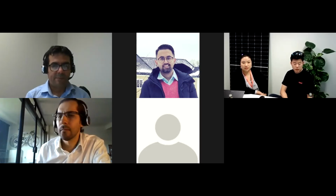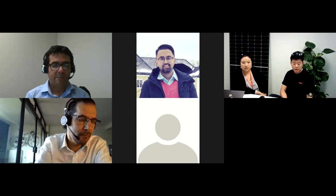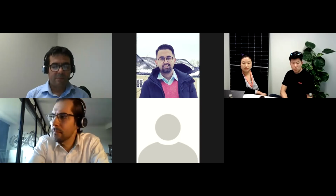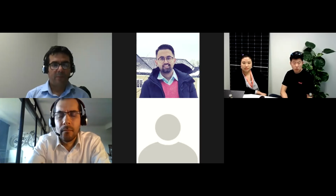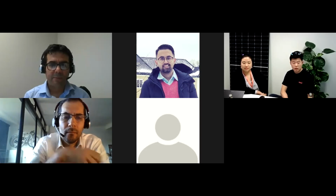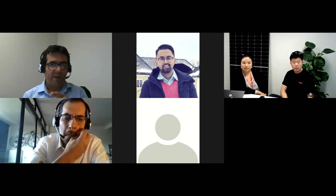And in terms of the limit on that efficiency, we've seen it's getting harder and harder to get improvement, especially on the P-type PERC. But still, there's something that we can do. There's still room that we can improve, and also to decrease the cost as well. So there's still space in P-type PERC. But we also look at other technologies like N-type or HIT.